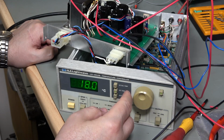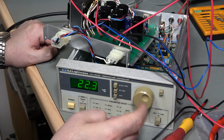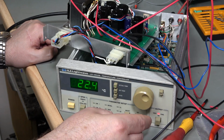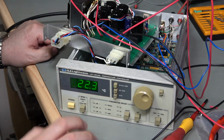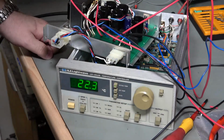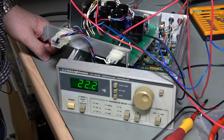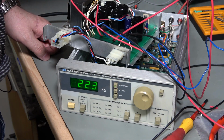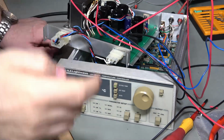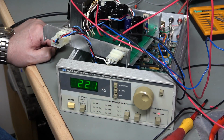Let me set my temperature. Make sure that's nice and high. Check my actual temperature. Yeah, turn on the heater. And the heater has failed to be able to deliver its current. I think that's what that error means. So if I set my current to constant watts, I'm going to try and draw 20 watts. I'm delivering 1.016 amps.